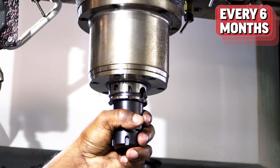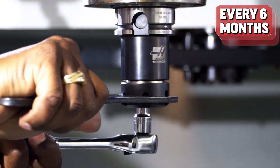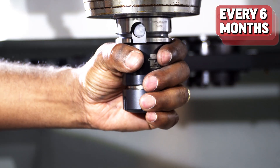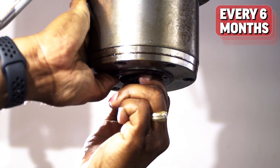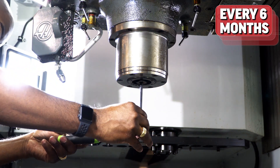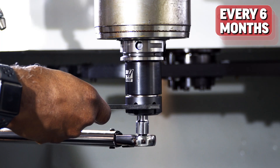If the spec is not correct, install a hollow tool holder with a collet lock into the spindle and use a collet wrench to hold the tool holder. Then insert a long 5 millimeter hex bit through the tool holder to loosen the locking screw in the bottom of the hole. The set screw is torqued to 20 foot-pounds. Remove the tool holder, press the tool release button, and rotate the clamping cone until the correct spec is achieved. Then use the 5 millimeter long hex bit to snug the set screw against the drawbar shaft. Install the hollow tool holder in the spindle taper and use the collet wrench to torque the set screw to 20 foot-pounds.